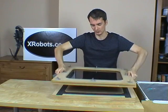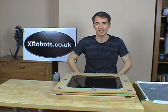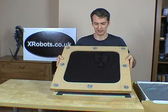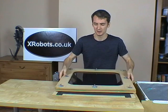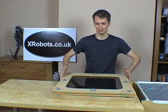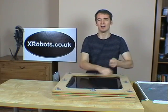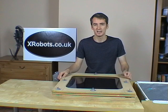If you can imagine putting that down over the mould, it holds it all nice and square. Obviously there's one thing missing which is heating the plastic — this is where a lot of people who build vacuum formers run into trouble. You could use an oven, but this is basically too big for a kitchen oven and I don't want to put it in the same oven I cook food in because fumes come off the plastic. I've also seen people take apart electric fires, make a wooden box with ceramic terminal posts, and wind the wire round to make an electric heater — but this seems quite dangerous. So I've come up with a much safer and better method.